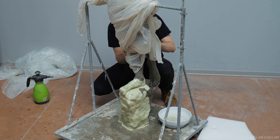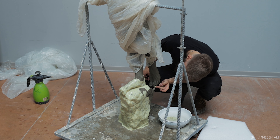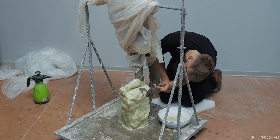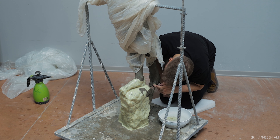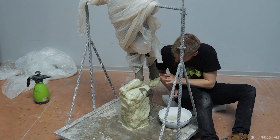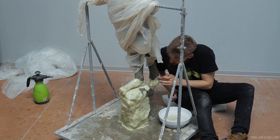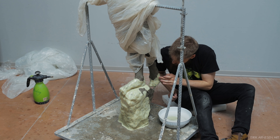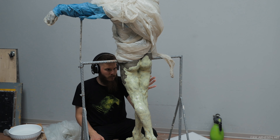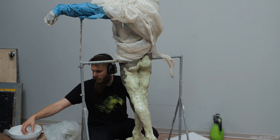The silicone I'm using here is a putty silicone from Blue Star Silicones called Blue Sil RTV3325P — I'll include the name in the description below and some links to some alternatives that are easier to come by. What's different about this silicone is that it is applied by hand, which is apparently quite unusual and somewhat of an Italian thing. Usually silicones are fluid liquids and they are brushed or poured over the surface of a piece. Even here in Italy people will often use a liquid silicone for the first layer because it captures details nicely and you don't have to touch your piece. When applying by hand the potential for dinging your work is always there, but a brush can ding your sculpture as well, or you can get brush strokes — so I'm not really buying into that argument.